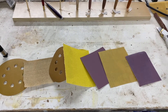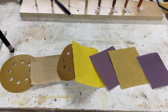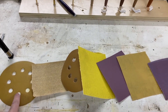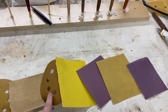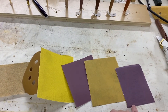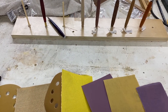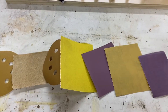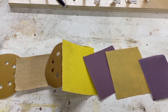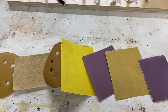It's time for a sanding party. Because I'm sanding wood with the exception of the black and white resin one, I'm going to start here. So: 120, 150, 180, 220, 280, 320, and 400. And then I have a whole different set of things to seal them with. I'm going to save you the sanding montage and come back on the other side.